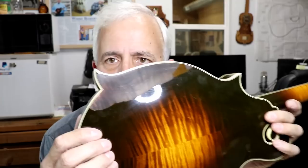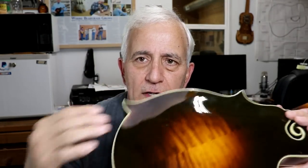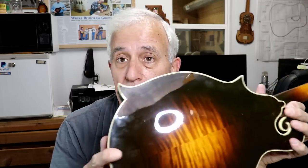So, I'm going to have to talk to the customer about all that. But I think before I get into this too deep in terms of the setup, I'm going to check out this varnish and see what we can come up with. If it is just nitrocellulose lacquer, I can kind of mask this off, build the lacquer up here, and then buff it together. We might be able to get it to look pretty decent, really. Probably still be able to tell it, but it would look better than that. So let's just see where we can take this.